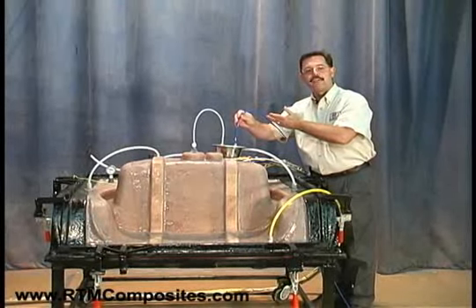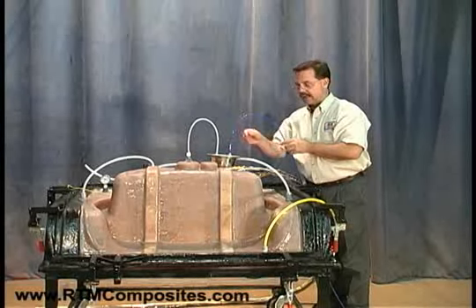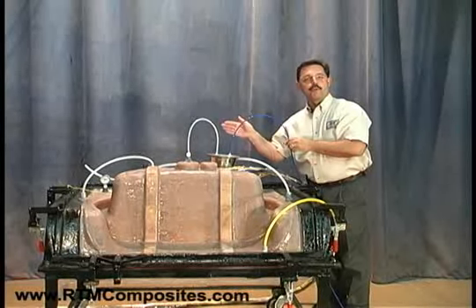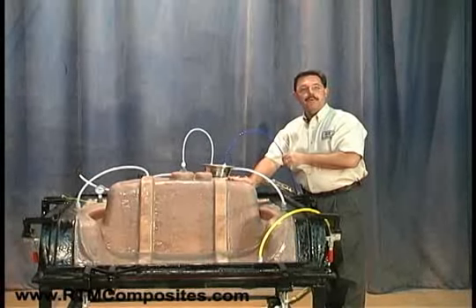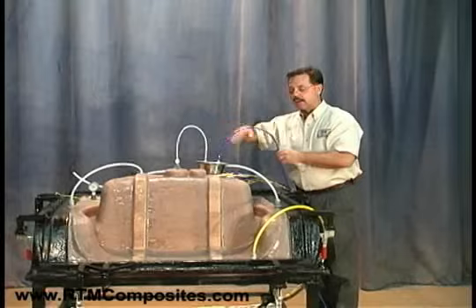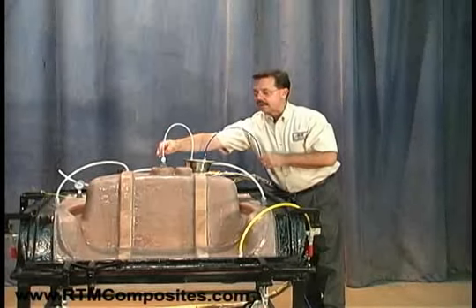The next line is the blue line, which is a regulated line. We've got this set at a half a bar of vacuum, about 15 inches. That's the controlled vacuum level in the cavity, and that's the level the machine is going to look for. It's saying: if I'm below 0.4 or greater than 0.6, I won't begin the injection. So we've got this set at 0.5 bar — negative atmospheric pressure, meaning the outside atmosphere is a half a bar greater than the atmosphere inside that mold cavity.